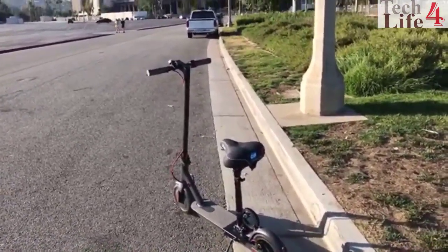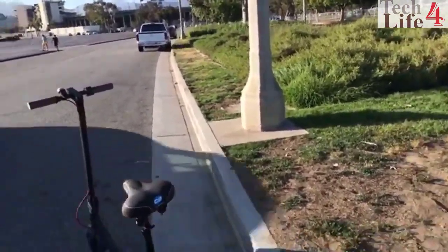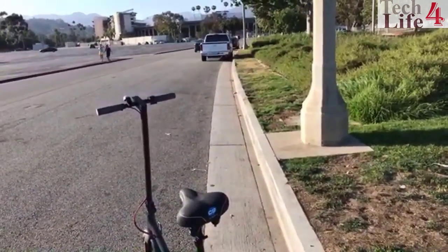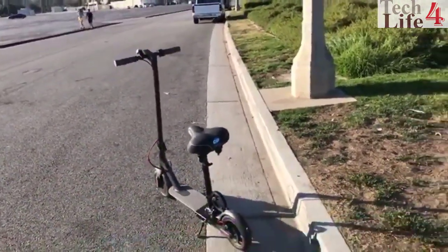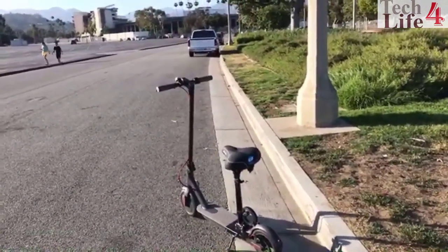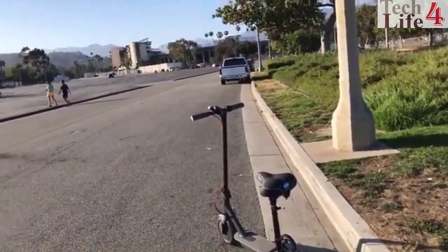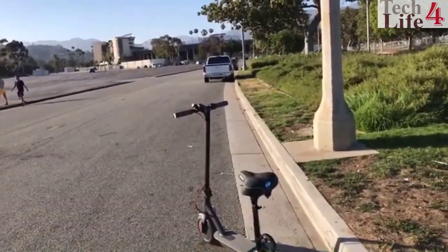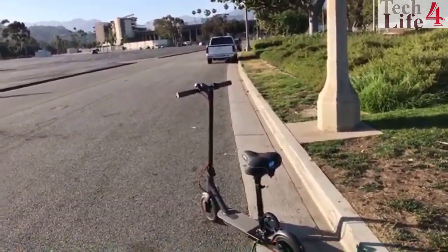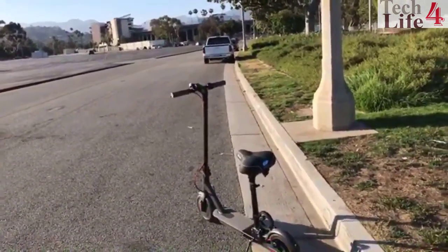And then Genasun. Genasun maximum power point tracking charge boosters. When you read in the comments, it can get confusing. Someone was like, oh, how do I boost my voltage? And then someone else is like, oh, you can't boost voltage from your solar panel. You can only lower voltage. Well, the Genasun boosts voltage.